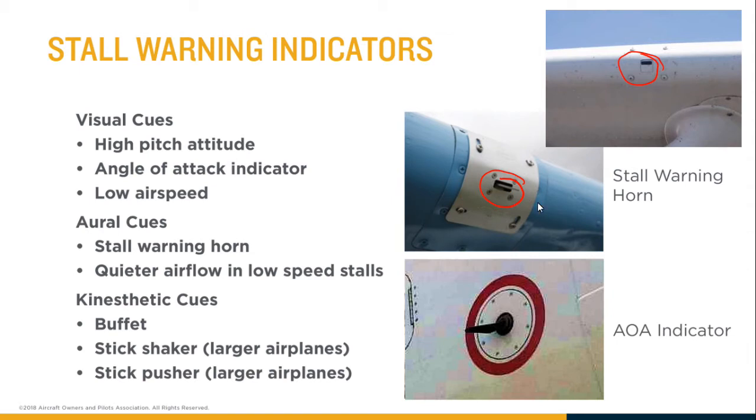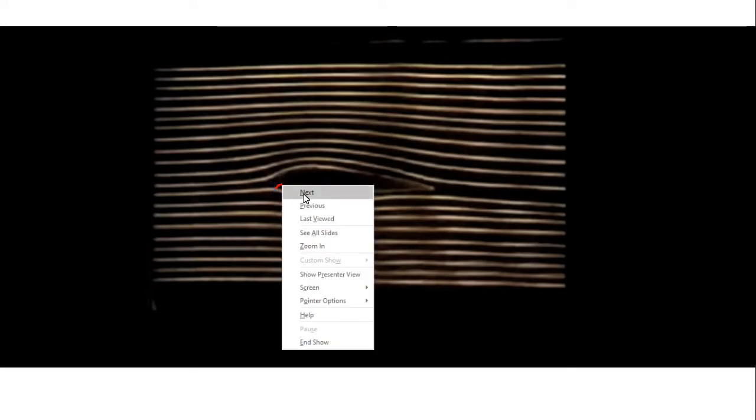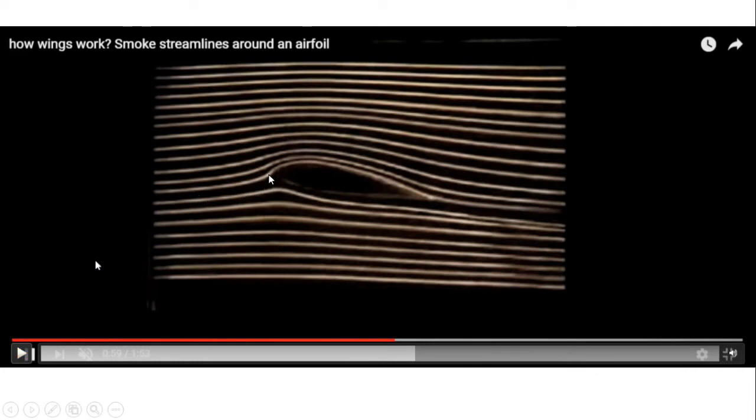To understand how they work, we'll go back to the wind tunnel. The electric kind has a little paddle that sticks out into the airflow and needs to get pulled up to activate. Right now the airflow would be hitting it and pushing it down. It's also spring-loaded in that direction. As long as it stays down, you won't get a stall warning, but as we increase the angle of attack, the point where the airflow splits changes and starts to move lower down on the leading edge.